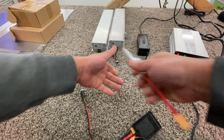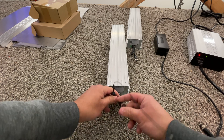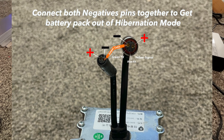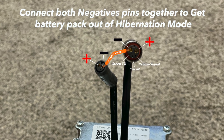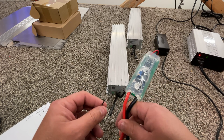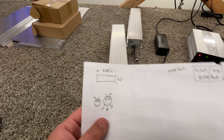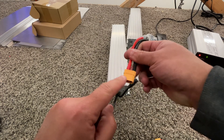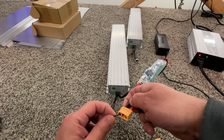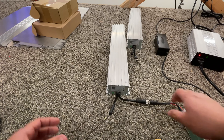To take it out of hibernation mode, what you have to do — using any small cable, as long as it fits in the little pins — is bridge both negatives of both connectors. Bridge the negative from the little connector to the negative from the big connector. Be careful not to bridge it to the positive, because you might short it out. Here's the negative pin — you bridge it to the negative pin of the other connector. It only works on some batteries, not all of them.